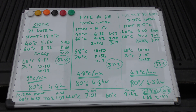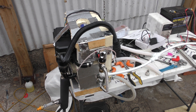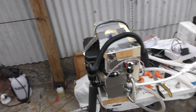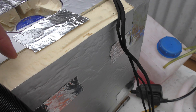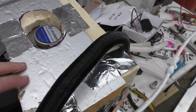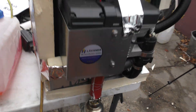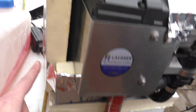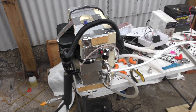As you've seen from the monstrosity, I've gone for insulating it. I've got the good insulation — polyurethane, basically expanding foam between two sheets of aluminium foil. I've covered most of the heater: the base, the sides, and the bits of the sides I could get to — enclosed it all — and then ran the test again.